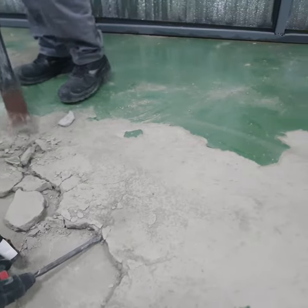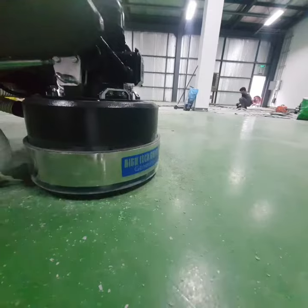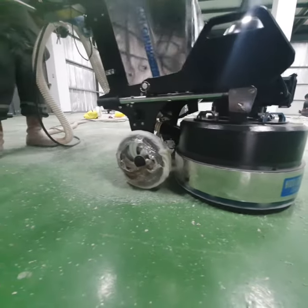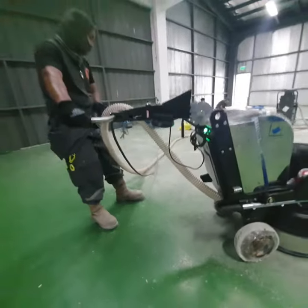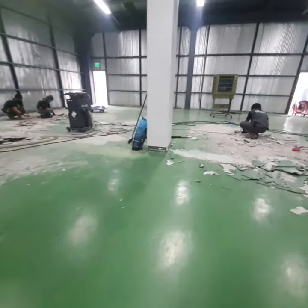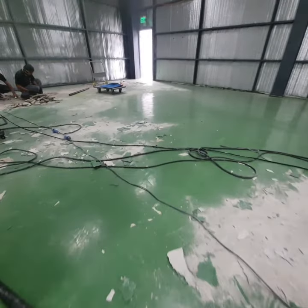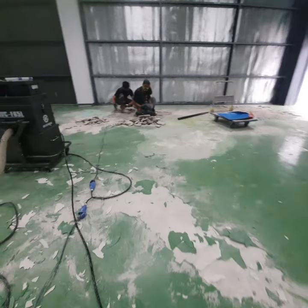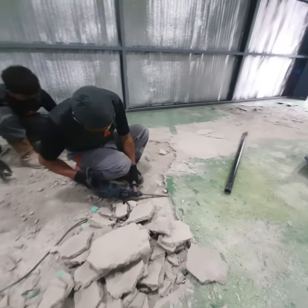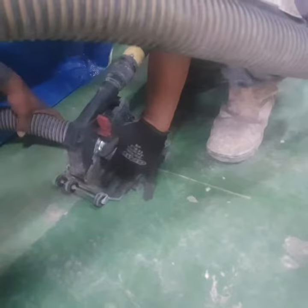Look how easily it was removed by our crew using a bush hammer tool. In some areas the substrate was fine and of enough strength, so we used our grinding machine and a PCD tool, while the rest of our crew was removing and finding the areas where a weak topping had been placed before by the previous contractor. So again, we're using here our bush hammer tool.